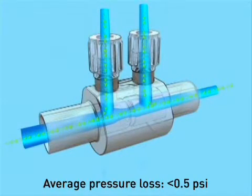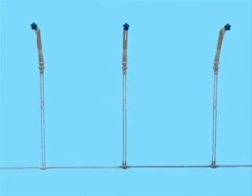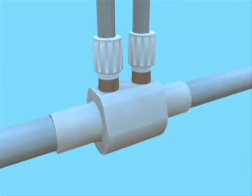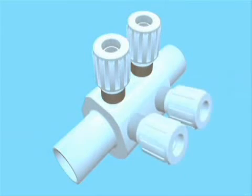This creates a pressure differential with a minimal drop in line pressure. The IFD is installed in the ceiling, wall, or floor of the main line, generally near the location of the faucet. Flexible supply and return tubing can then be installed to the faucet locations. Faucets can be located up to 50 feet from the IFD, and each IFD can supply up to three AquaTap faucets.